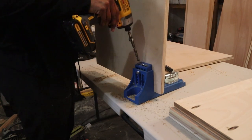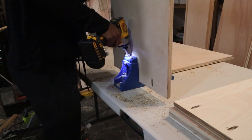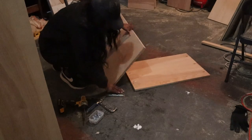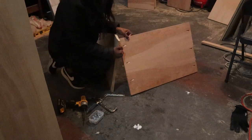During this entire project I will be using the Kreg pocket hole system to create pocket holes to attach my boxes together. I found that this system was the easiest method for me — I'm able to take it apart and just screw something in rather than having permanent nails in there, so if I did make a mistake I could take it apart and fix that.